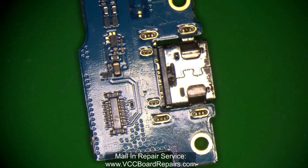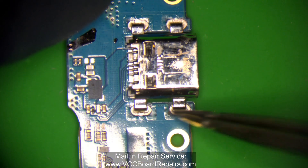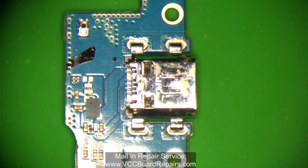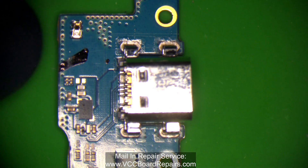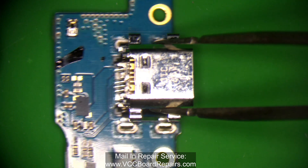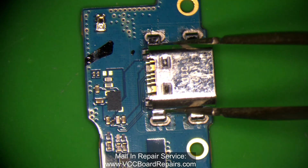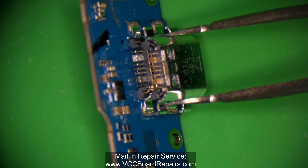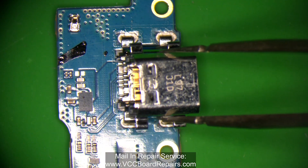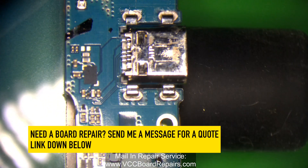It's also good to look at the port itself. You can see there are six anchors — basically pins that are grabbing on for structural integrity — four on the top side and more on the other side. For this specific repair I will link to this port, but every model might be different, and you might have to stock many different types of ports. They're actually pretty cheap though. The key is to make sure the anchors line up and the pins are the same. Some ports look identical but the pins or anchors don't line up. You can also modify an existing port to fit in a pinch.